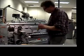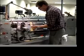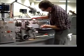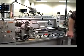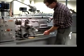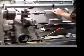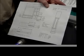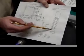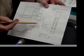You can just smear a little bit of wax on that drill bit. Get it in there. Get it right on the tip. That'll help to lubricate it. And you don't want to drill real fast. You just want to apply light, constant pressure. Okay, we just machined this portion of the screwdriver down to I think it's 0.8 in diameter.